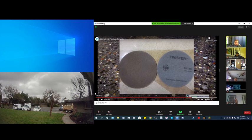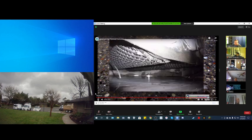cleaning pad, which is roughly a 6,000 grit diamond impregnated pad, followed by a super shine pad, which is roughly 10,000 grit. Conversely, if there are no topical treatments that have been previously applied, the use of what is referred to as a DOI pad, distinctness of image, can be used to preserve the gloss and the clarity since there's no film buildup on the surface. It is imperative to check with your polished concrete contractor for their recommended procedures using diamond impregnated pads like seen here. Be very careful on the type of brushes and pads used.